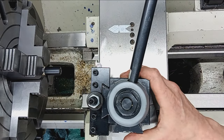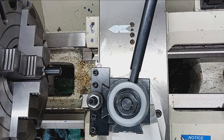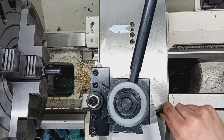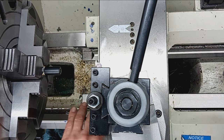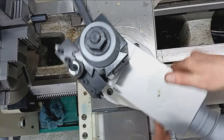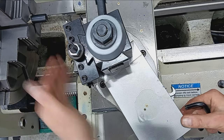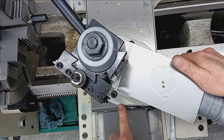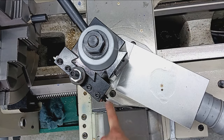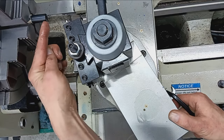The first thing to do with threading: you've got a compound rest on the lathe, a cross slide, and an apron or carriage. We need to set this up properly for the job at hand. My compound rest has two opposing large cap socket head screws that allow one to rotate the compound rest to any angle you desire. For this particular job we need 29 and a half degrees. There are graduation marks on the compound rest. A big mistake a lot of newbies make is setting it to 29 and a half on the wrong plane — that is incorrect. We want it off of this plane here, because we're doing the work here, not straight ahead.